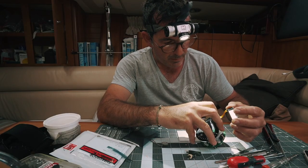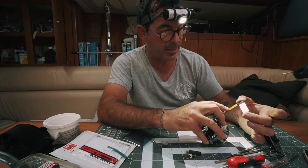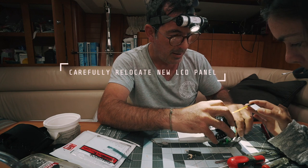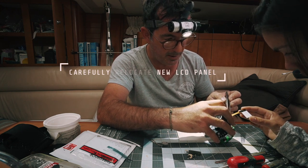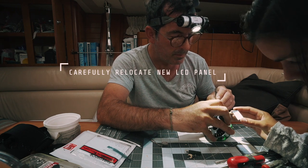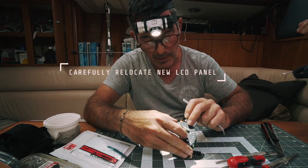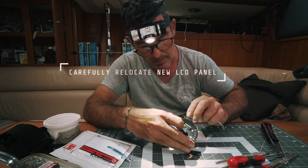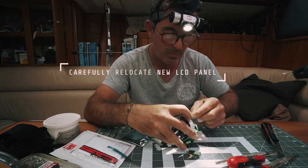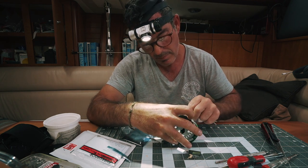With everything clean and ready, push the new LCD engine hour meter into place. The ribbon connector is pretty new and needs to be carefully pushed through the slot that connects it to the circuit board. An assistant held the engine hour meter while we gently used tweezers to bend the ribbon connector through the slot. Once the ribbon end was pushed through, we relocated the new LCD in the position the previous one occupied, pressing firmly with finger pressure — there was enough contact adhesive remaining without needing more. Similarly, the printed dial from the rev counter still had contact adhesive and was simply pushed back down to relocate it. If you need a little more contact adhesive, simply apply it using a Q-tip.